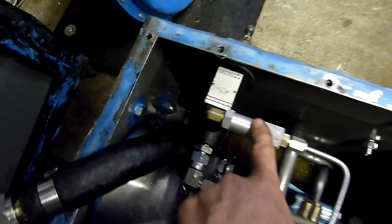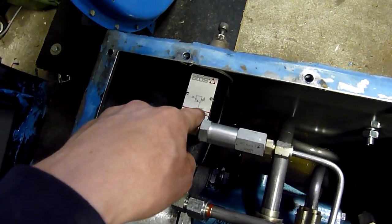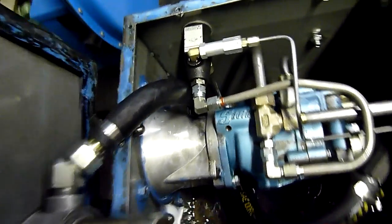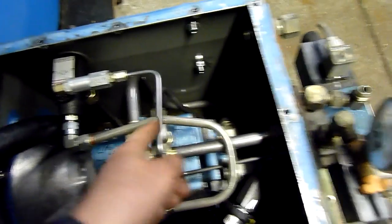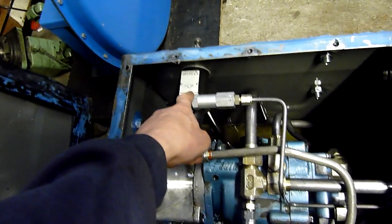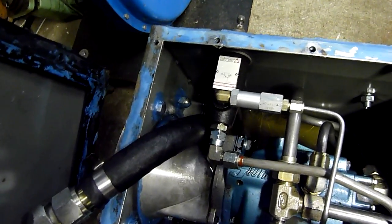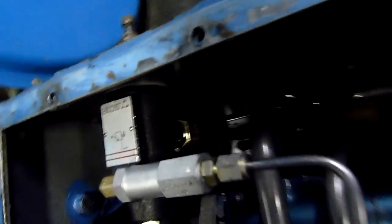It's got what looks like a pressure regulator with input, output, and then pass regulation to the valve block. Actually, I think it's pilot pressure. Looks like there's a pilot pressure line, and then this must open only when the system is loaded up — like if you bottom out the end of a ram on its travel, this must open up. So it's more like an over-pressure protection valve, but it dumps straight back to tank.